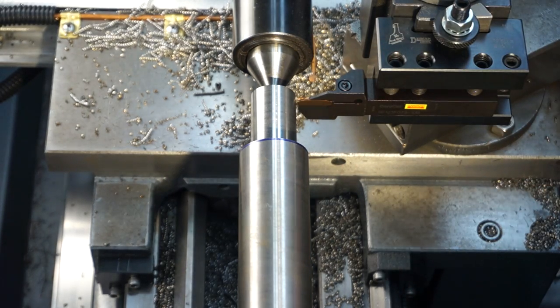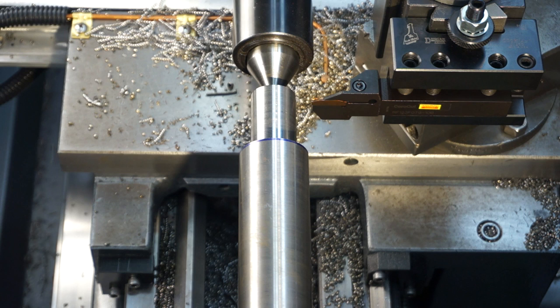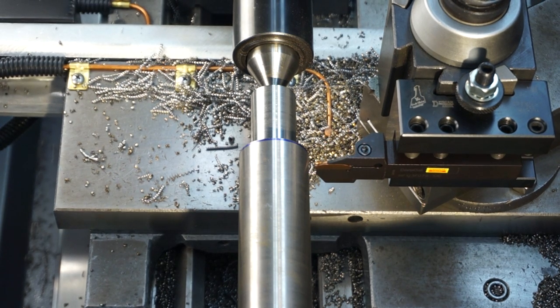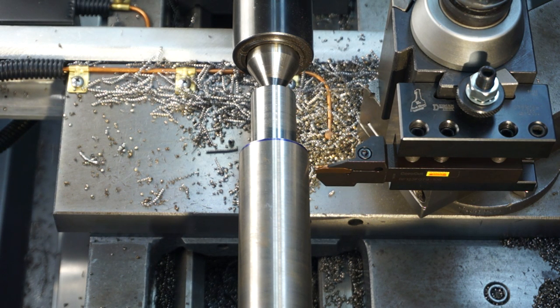But for right now, going in and roughing out our positions, we're going to set our shooting star technology readout at 0 there. Our first shoulder, on the back side of where the wheel locates, is 1 inch 771, so we're going to come over here to 1 inch 781. We're going to leave ourselves 10 thousandths on the plus side.